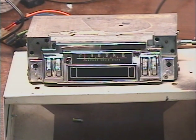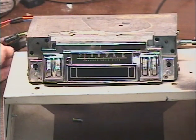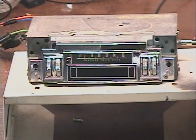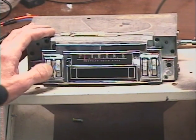Alrighty, so let's go ahead. This is just a basic FM conversion with your USB and Bluetooth functions. Of course, I've got the line input. This customer has requested that we use his original connectors, which is fine. We just don't get that massive increase in power output. It's just going to be a two-channel radio like it was before, except now it has FM, Bluetooth, and USB reader. So let's go ahead and turn the radio on. I've got it set to FM at the moment.